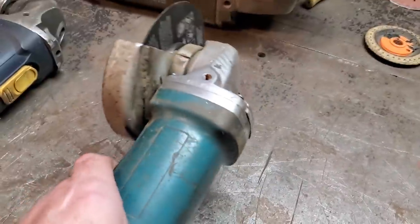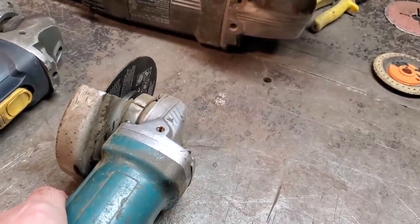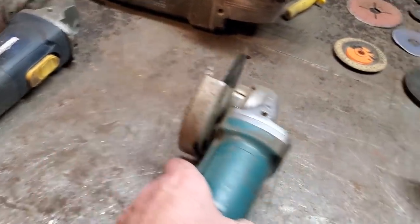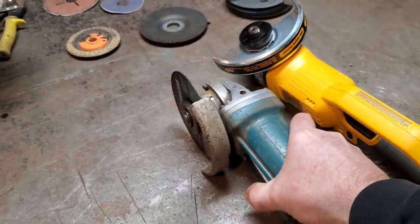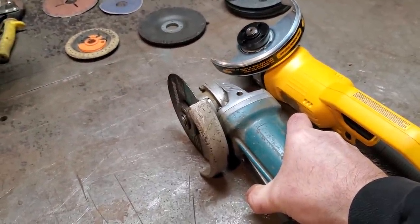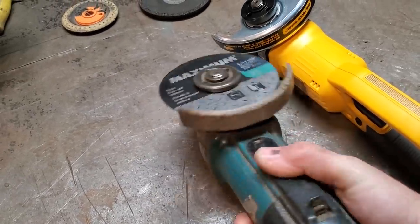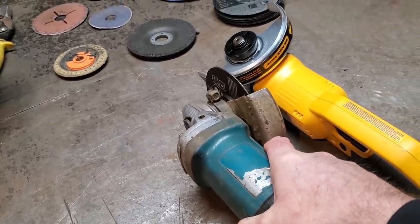I hold it in my left hand. This is the advantage of holding it in your left hand, because it's on the outside of your body. Like I stand here now, this is my arm, and the grinder's on the outside of your body. If you are right-handed, this is the problem you got. You're holding the grinder, and the grinder's on the inside of your body. It's hard, and you can't work the grinder this way because now the grinder's spinning backwards.